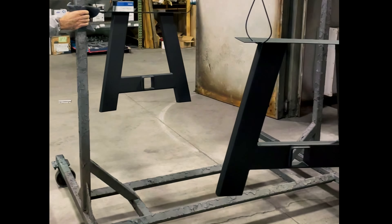At this stage in the build, especially with the top laying airtight directly on the table, it's important to cover the other side to prevent cupping. I used plastic and towels anytime I'd be away for a while or overnight. I swapped out the surfacing bit for a flush cut bit and clamped down some leftover trim pieces to use as a guide — it was time to route out the channels for the legs and supports. I've only done minimal plunge routing outside of using my CNC machine, so I expected some hiccups. This ended up being really laborious and took a long time, requiring multiple passes at different depths. I'm pretty sure I needed a sharper router bit or maybe even a heavier duty router. No matter the cause, I definitely need more practice at this part.